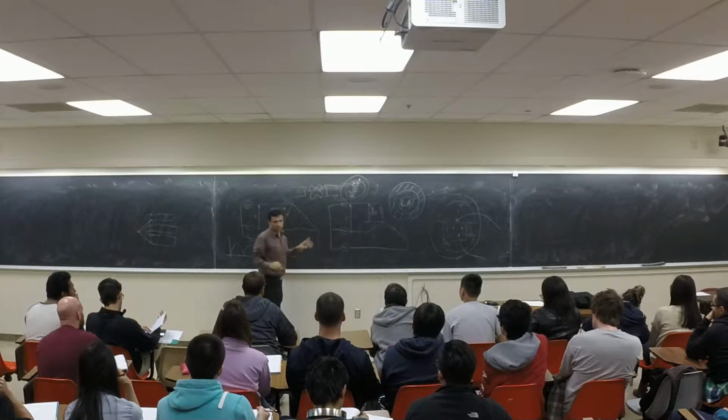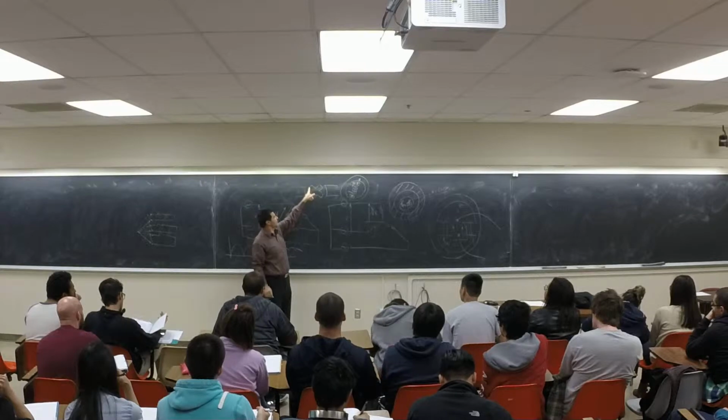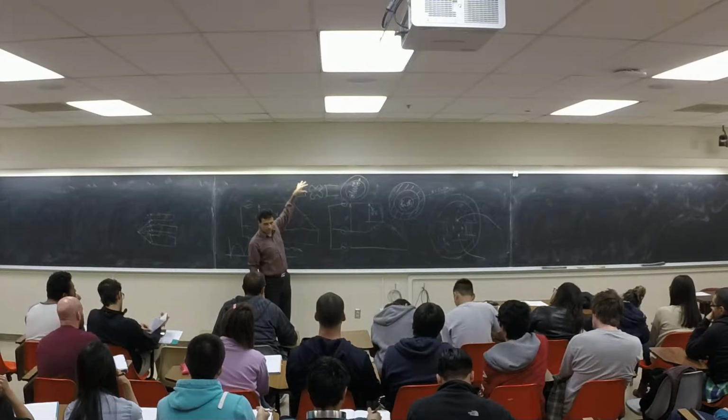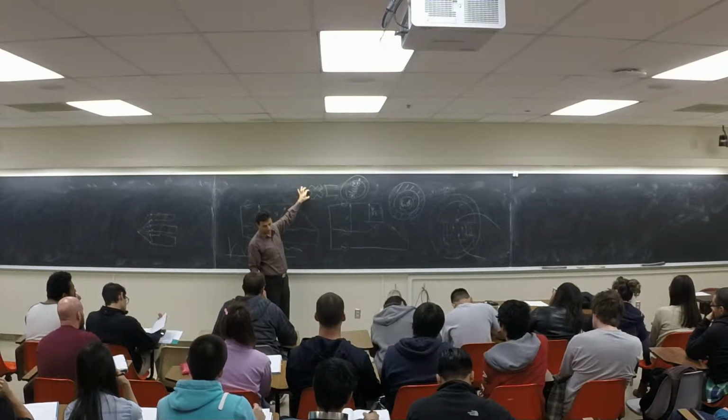They call it switched reluctance machine. Basically, the reluctance of the machine is going to change. See, if this one is here, you can see how much reluctance you have. When this one moves here, we have a bigger air gap, right? We are going to have a bigger reluctance, right?